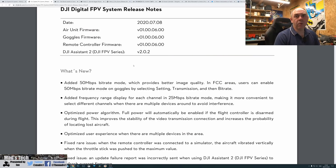The new 50 megabits mode essentially takes over the HQ mode, and the low latency mode has been improved as well — they've just tweaked the quality without increasing latency. I cannot give you opinions on whether this helps with range or gets past the 6.5 kilometer barrier people have been struggling with, as it's still early days. The feedback so far is that it is a nice improvement and overall quality is much better, but it will take a little time before we really know the full effect.